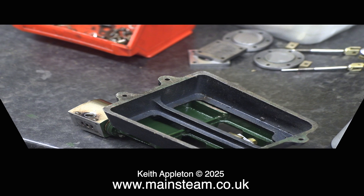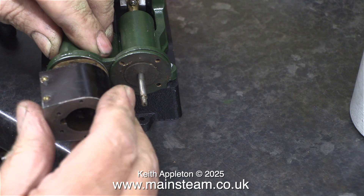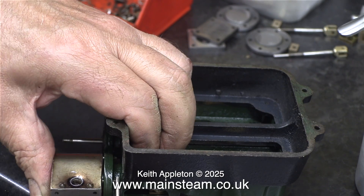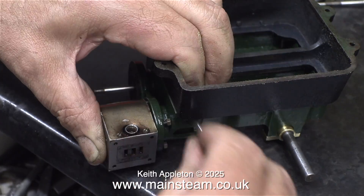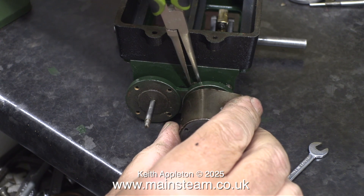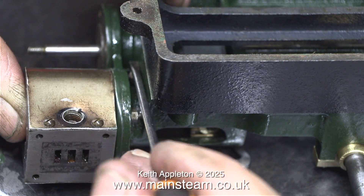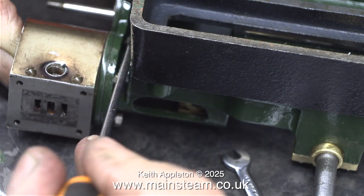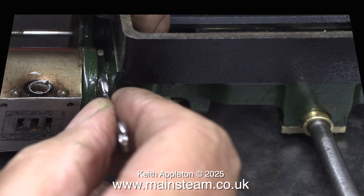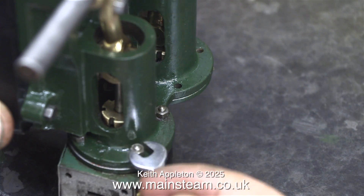Now it's time to fit the first of the cylinders. These are not as easy to fit as you would think — the top nuts are easy to get at, but the ones underneath are quite well hidden. The first thing is to make sure the cylinders are the right way up, not like they were originally. Because this cladding was once uppermost for many years, it's discolored and faded. The good thing is the engine cylinders look like new from the top — an unexpected bonus. Fitting the nuts on the lower part of the cylinders is quite difficult.